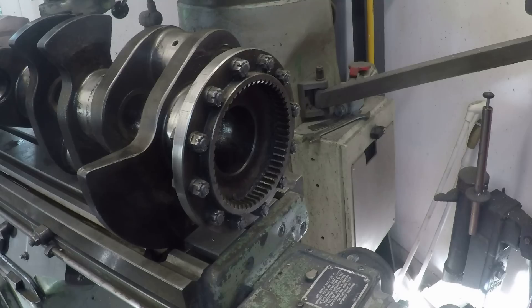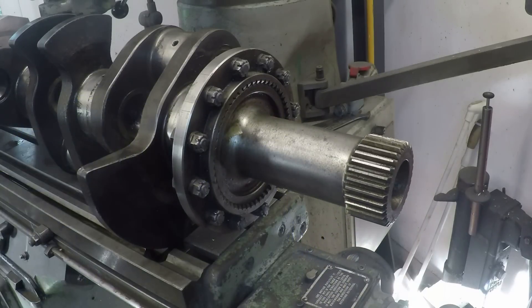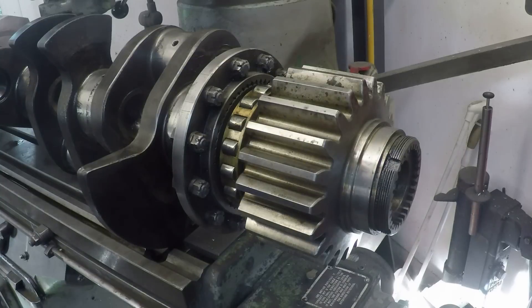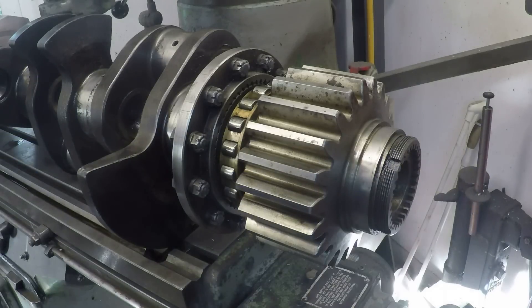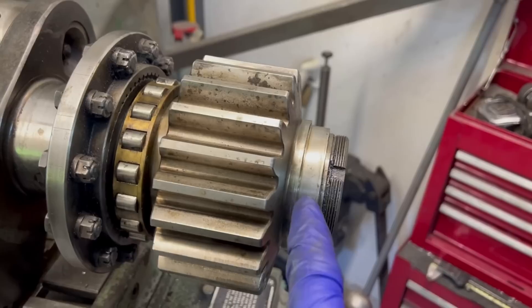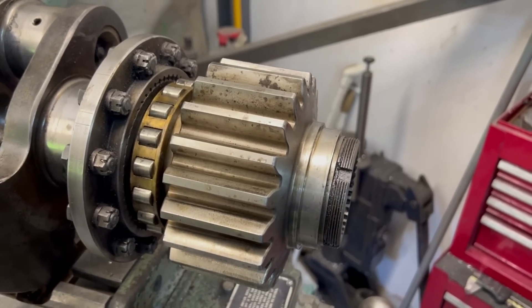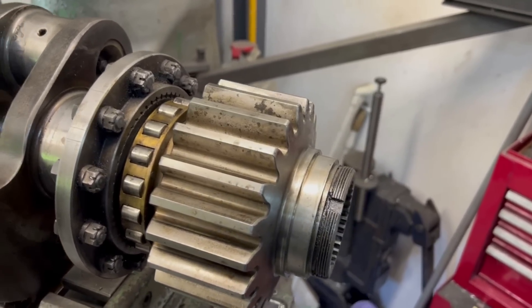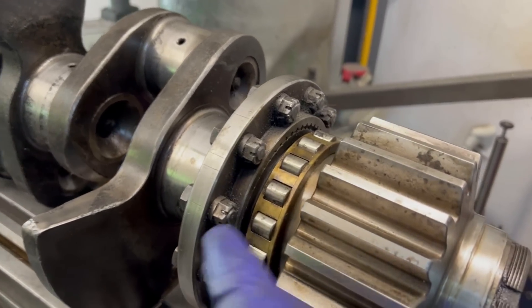Moving to the front end of the crankshaft where we drive the propeller, there's a coupling shaft which is designed to damp out some of the torsional vibration, and then the reduction gear pinion. The pinion is supported on two sets of roller bearings and is completely independent of the crankshaft, the only connection between the two being the torsion shaft. What they eventually discovered was that because one roller bearing is located in the engine crankcase and the front roller bearing was located in the reduction gear cover, it required very accurate machining to keep the two in line. If the front bearing was a very small amount lower, the action of the splined coupling shaft would cause the crankshaft to push back.